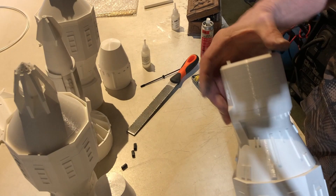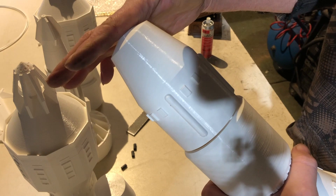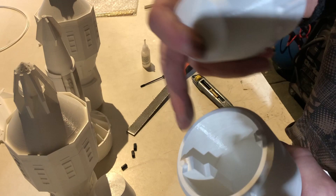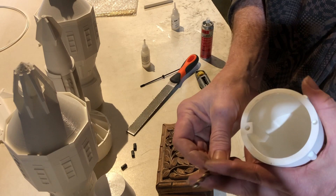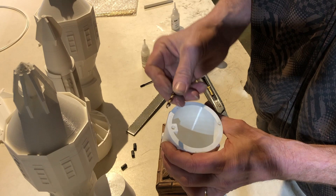Next little mod I need to do before I can assemble it is to excavate these little holes on the back of here that are printed in. There's just a little bit too much grip with those as you push them in, and as they're locating pins I'm going to have to take it off again. I've already broken one of them, so I know they're too tight to do a test fit without breaking them off. If you drill into a 3D printed part with a normal drill bit it'll do it, but if you're free-handing it, this edge is going to grip like hell onto that material and drive straight in - you'll probably split the print.